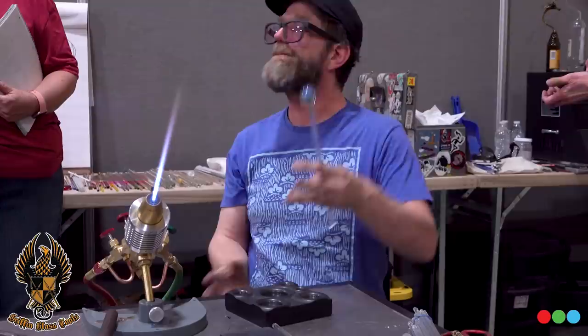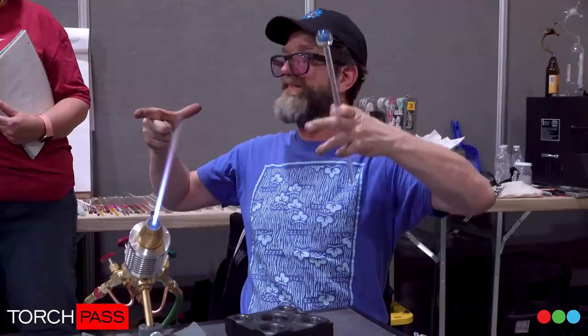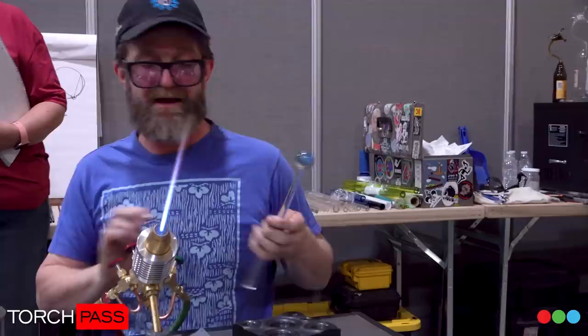Remember, your marble is not in the mold being compacted by the walls — it's a single edge. If that single edge skips by an area, you're not really compressing your marble. Keep that in mind — everybody wants to drop fast and stir the pot, but those things work against you.